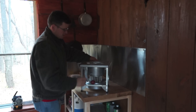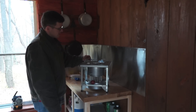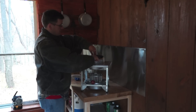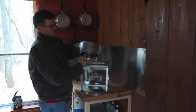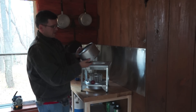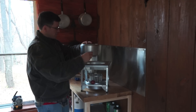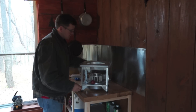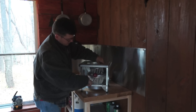These are made in Indonesia. They're very common in third world countries. I'm going to take the burner off and check how it all goes. You get this through the top — you tilt it and come in. This is the catalyst. It keeps you from being killed by CO, just like a kerosene heater in your house would do. You can move it back and forth to get even coverage off your wicks.